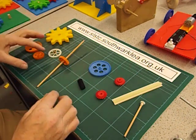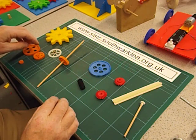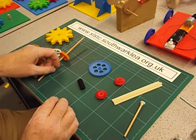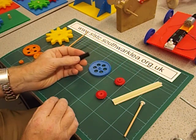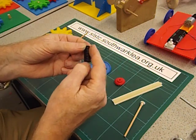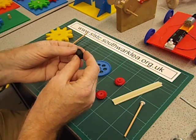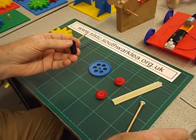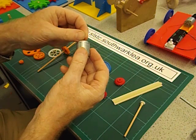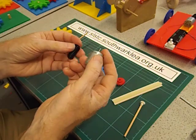There are lots of different kinds of spur gears, different sizes. When you're using them, make sure you're using gears from the same set, otherwise they won't actually mesh with each other. This is called a worm gear. It's like a single tooth that's been spiralled around a cylinder, and it's used to reduce speed. It's particularly useful when using electric motors, which as you probably know spin really, really fast, and we often want to slow them down and also get more force out of the motor.